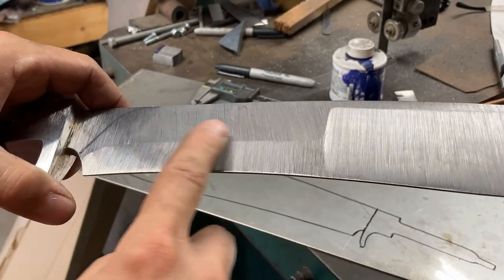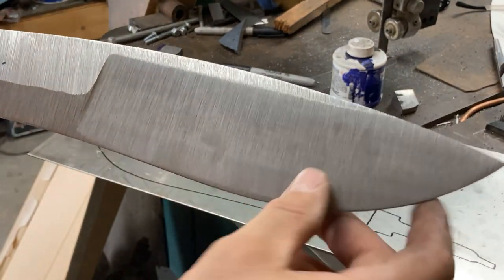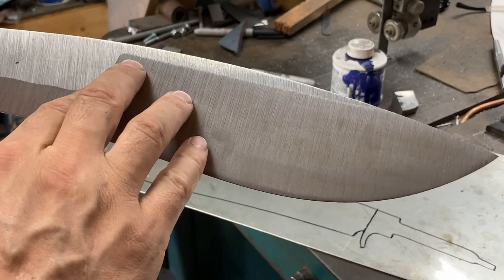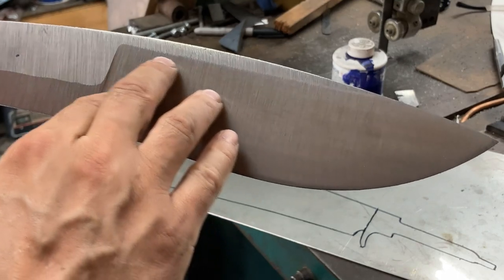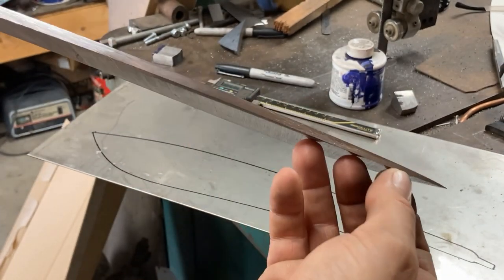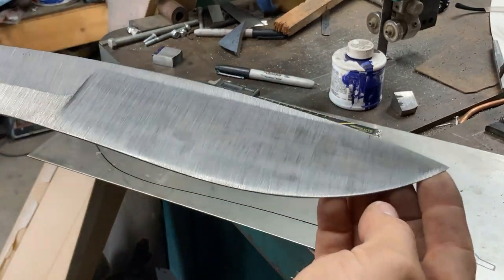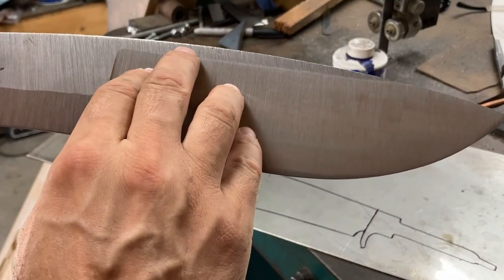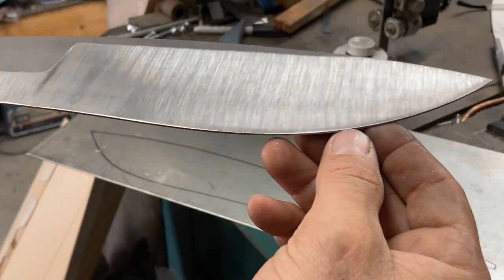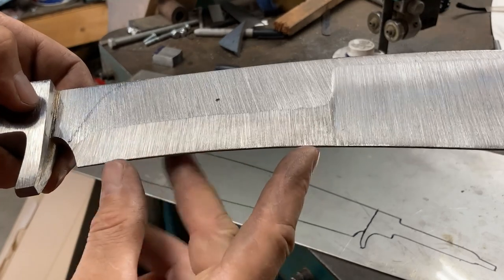In the recurve section I use the corner of the platen a little bit by angling the blade out. Here in this wide section I can use almost the full width of the platen. Right now I have a pretty straight line across the top of this grind — that's an easy way to make sure that your grind is even, trying to maintain a fairly straight line. As we get up to the spine I'm going to allow it to curve a little to follow the spine, and I'm going to make sure not to get my distal taper too thin here — we don't want a delicate point, not thin enough to be a liability on a chopping knife. We've been walking the grind up — soon it's going to meet the spine. I'll probably stay a little bit short of the spine with this 36 grit, and then I'll do this section in the same fashion but relying a little bit more on the corner of the belt to grind this slightly recurved section.